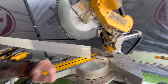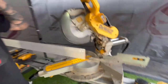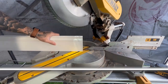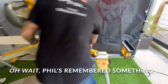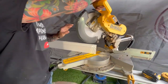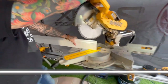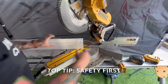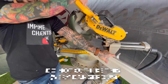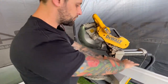We're going to switch the saw on with dust extraction, and we're going to put our goggles on. One more thing before I make this cut: if you're right-handed and using a saw with your right hand, you're going to hold the piece with your left hand. If you need to cut on the left side, crossing your arms is not acceptable — don't do that, it's too dangerous. Always cut with your left hand on the left side. Never cross your arms on a saw.